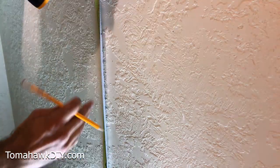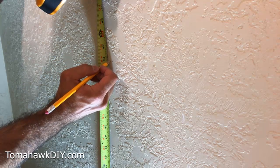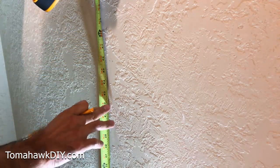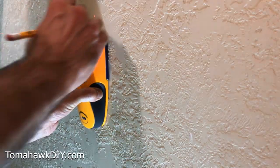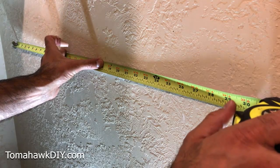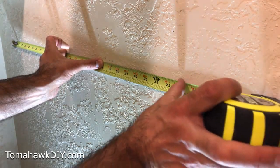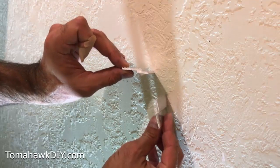Confirm the height first. This one I'm going to mount with the bottom of the rack at 42 inches, which means I want 46 inches where those screw holes are. But I'm actually not using the screw holes, so I've got a little more leeway. I know that 46 inches is a good spot. I'm going to check for my studs — I've already checked the other side of the wall. I've got one power outlet down below; the other one's going to be about 16 inches over. My coat hook is 30 inches long. I could put the clip in the stud right here, but I want it centered fairly well, which means I want another one over here — one in the stud and the other will use another anchor. I've got these clips.